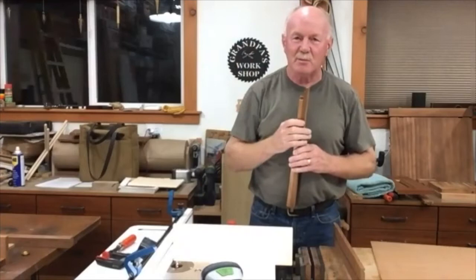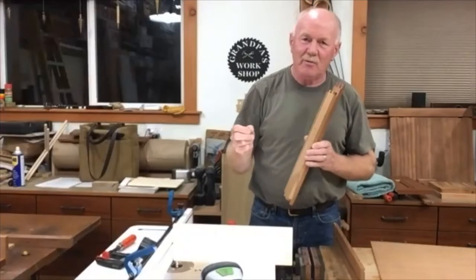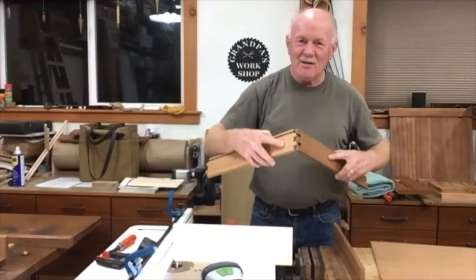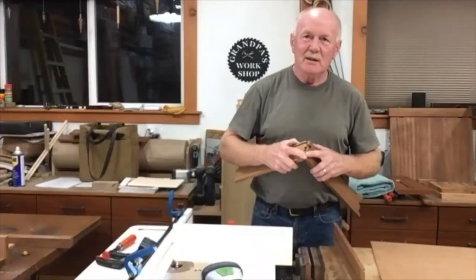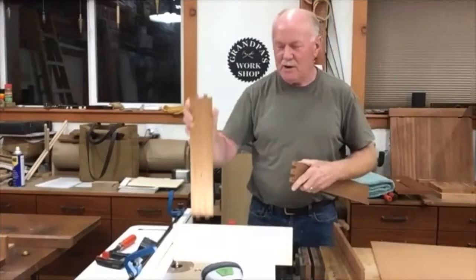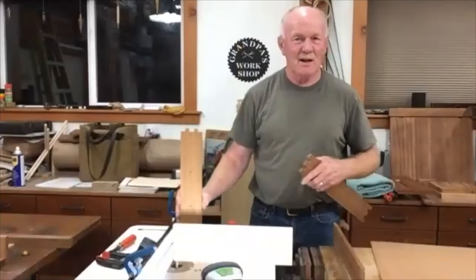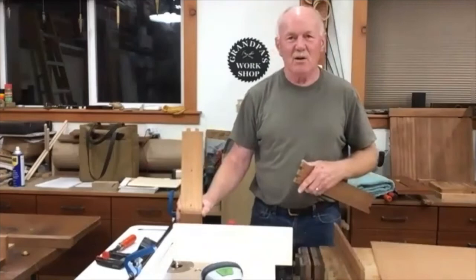Okay. Backers help a lot, you know, really sharp, really clean blades help, of course, and the angle of address. It's a highly visible joint. And if it's not a clean, tight fit, it really stands out. The process with a dado stack on a table saw is virtually identical to the process on the router table, and a spiral cutting, up cutting router bit always gives me a cleaner cut, and it's no different process. So that's my default. Got it. Okay. Thank you. Yep.